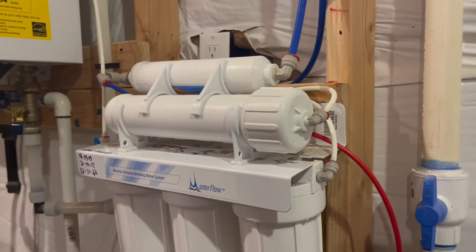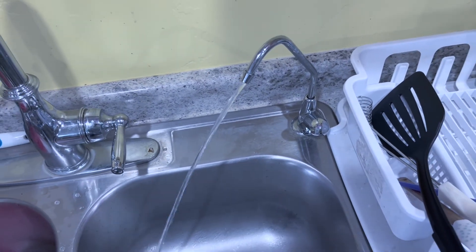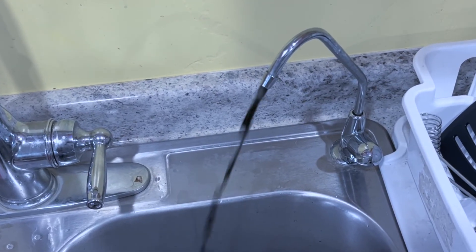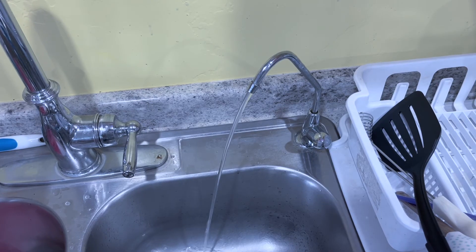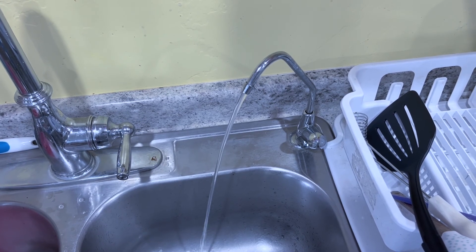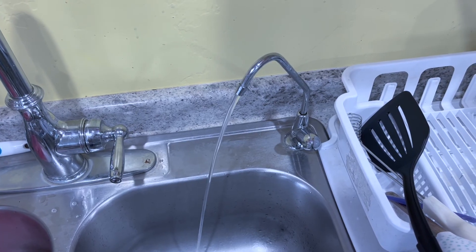It could do a lot of damage, so make sure to look it over real good. Go up to the faucet and purge — you'll notice there's going to be some black carbon coming through; that's just some of the normal dust that's with the filter. I want to give that plenty of time to purge, so I'm going to drain down the entire tank — just leave the faucet running until the pressure disappears. I'll do that two or three times, and by then it should be ready for use.